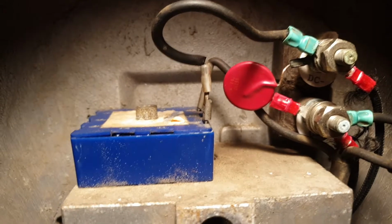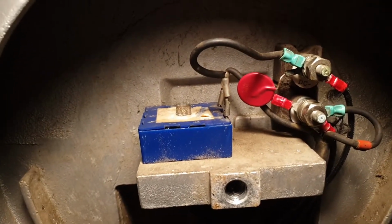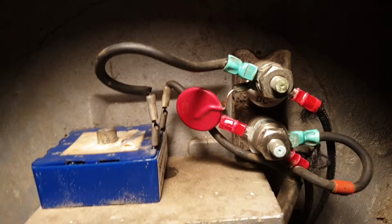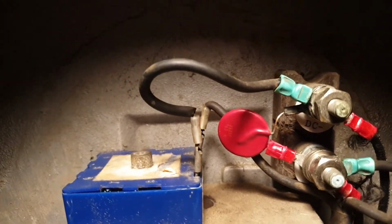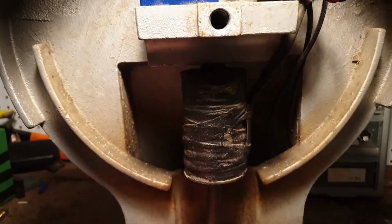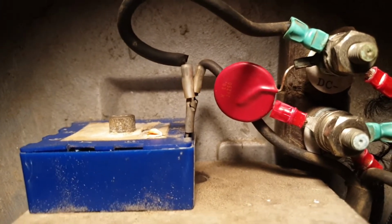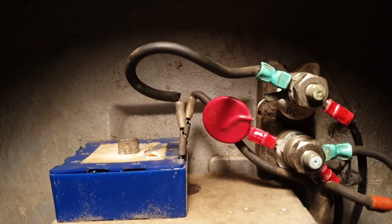So the idea here is that there's some amplifier in here, and it's going to boost up the signal to something that is capable of lifting this. And once that voltage is reached, the clamping takes effect. It closes, the coil de-energizes, and then it strikes the bell. The clamping voltage is somewhere between 19 and 24 volts. So once it sees 19 volts minimum, it's going to close.